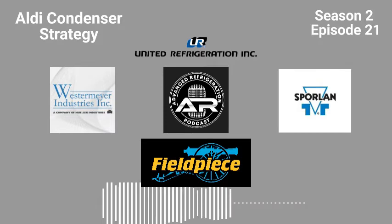This gets a little different than most guys are used to seeing. At the Aldi stores — smaller formats — whether it's a Protocol or a CDRU unit on the roof, they both use the same condenser strategy. This comes into play with micro-channel condenser coils. They are running two different condenser applications: a winter condenser with just the two header fans, and a summer condenser with all the fans. The reason is to reduce cycling on the micro-channel coils and better match the condenser capacity to the rack depending on the ambient.